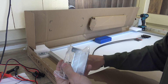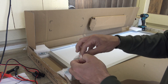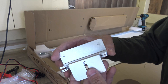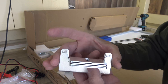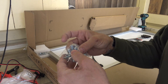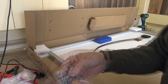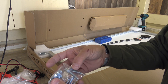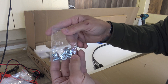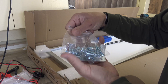You have a series of hardware including aluminum mounting brackets — 4 of them. These are the same exact type I use on my big solar array, so these are good brackets. You also get self-drilling screws with little rubber washers for water tightness — about 10 of them. And you get the nuts and bolts that go with the brackets to mount them to the panel.